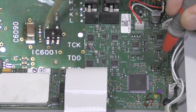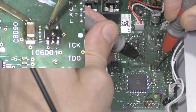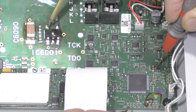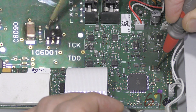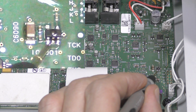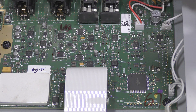So I see that this output is connected to this capacitor, this capacitor, and this capacitor, and also this unpopulated connector with markings where this pin is marked 3.3 volts. And the input is connected to this relatively large inductor. I guess there is a step-down converter here next to the DC input connector.